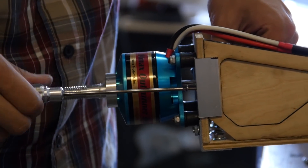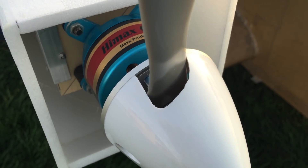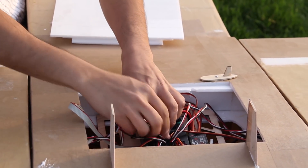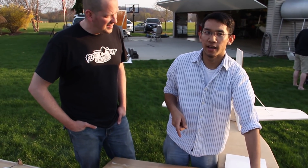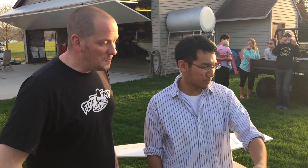The motors are Himax 6320s, 250 KV — but I'm pretty sure the KV is wrong on the motors because I'm not getting anywhere near the numbers I should. With the current 20x8 propeller and a 10-cell 10,000 mAh LiPo at full power they should be pulling roughly 60 to 80 amps according to the manual, but I'm only seeing around 30 amps. 30 amps per motor — something is not right.